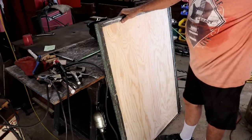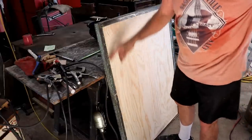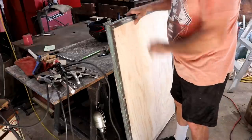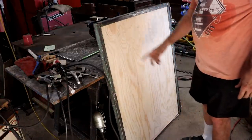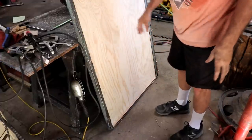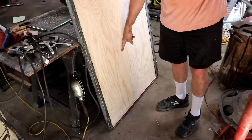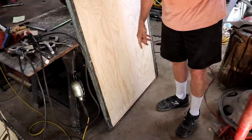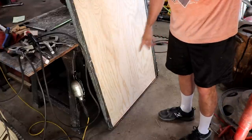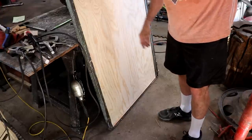It's stitched on there. I've just got this cap sitting on here at the moment — the cap has not been welded on yet. I'm thinking about it before I weld it on there, because after you weld this on, you can't get the wood back out. This is marine plywood — we bought the better stuff. I had to more or less dado out around the edges so it would fit in there. The new steel is just a hair thicker than the old steel, so that's probably why we had to score the plywood all the way around. This lip that goes all the way around is missing down here — I noticed that after I put the plywood in. I'm thinking I might want to leave that off anyway because all the liquids go that direction, they'd just build up behind that piece of metal, and that's probably why it rusted out so bad. I'm tempted to leave it off so it can get air, dry out, and be cleaned out better. I'm going to give that some thought before I weld this together and make it permanent.